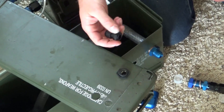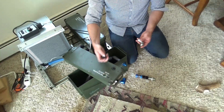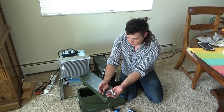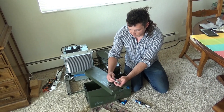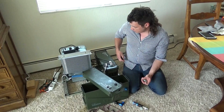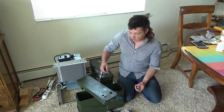Where you put it is not very critical, as long as nothing interferes. If you just drill two holes, you can use either grommets or these kind of strain reliefs — they come in different kinds that cost different amounts of money. You can use these strain reliefs and it works quite fine, and then if you give yourself just enough cable, you can pop the lid and work inside with no issues.